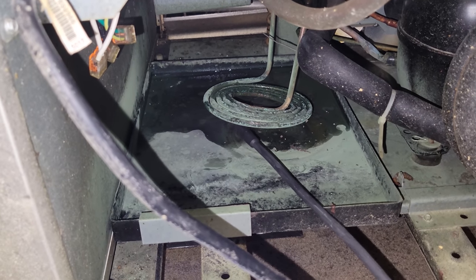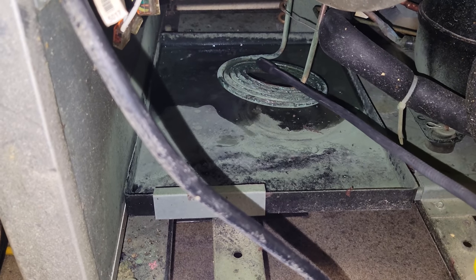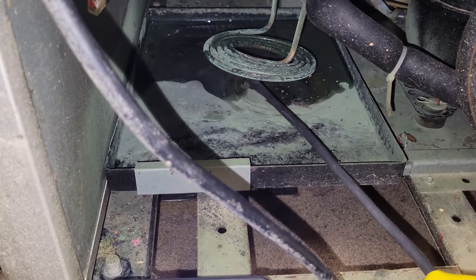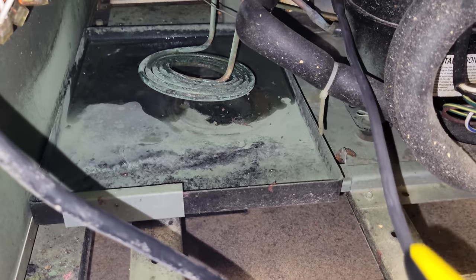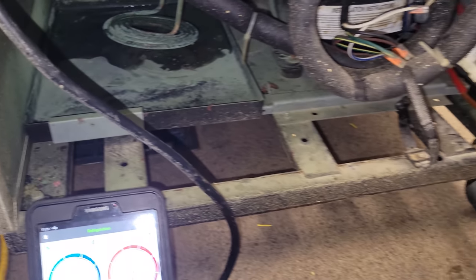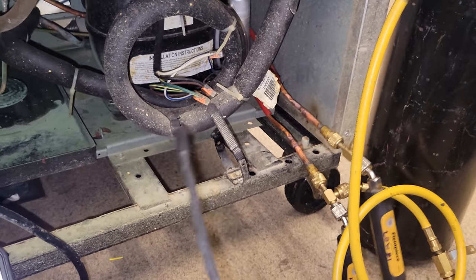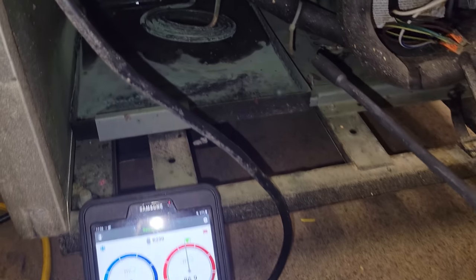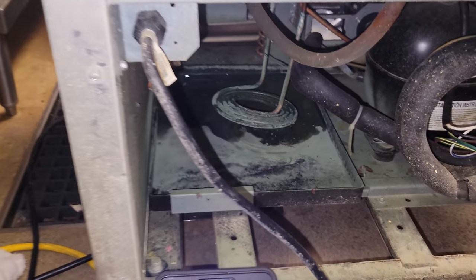Still nothing, man. I mean, it's always a possibility we have a capillary tube problem, but I don't think so. Huh. No leaks, huh? That's interesting. This guy picks it up. I mean, we can prove it right now. There, I just sprayed a little bit out of that. Let's see. There, so the leak detector works for sure. Usually it's at these dang condensate heaters.